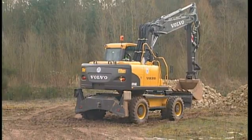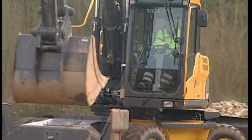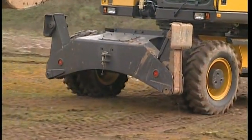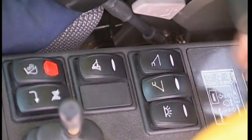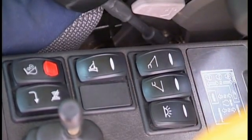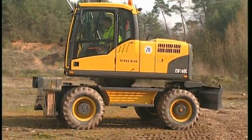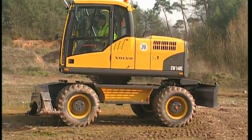Make it a rule to use the outriggers and blade as a support when lifting. If you have outriggers on the undercarriage, you are able to level yourself to a certain extent. The outriggers as well as the blade can be used individually. The toggle switch must be activated for each support, which can smoothly be moved up and down using the joystick on the left-hand console. If you only have a blade as a support, you can operate it directly using the separate joystick.